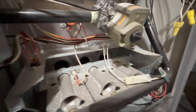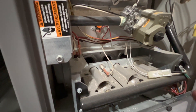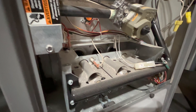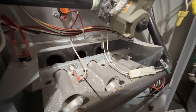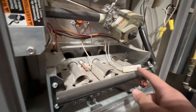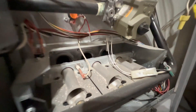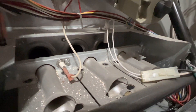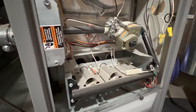There is one other component that is basically very important. The question is, how can you get a flame without any ignition sequence? So this wire right here — this is a hot surface igniter. Basically, this thing glows when it's warming up, and it's actually really bright, too. It's like an incandescent lamp. And this is the wire that goes to it. So if the igniter goes bad, you can obviously change it out — this plug right here — and you can get a brand new igniter online. That's the hot surface igniter. It'll glow for a good amount of time, and that is how the flames establish and produce their color and stuff like that, which I think is pretty awesome.